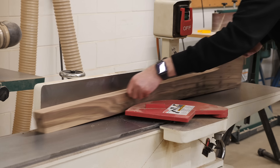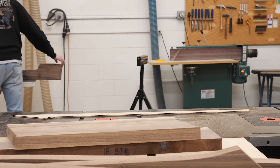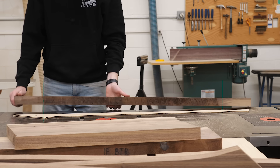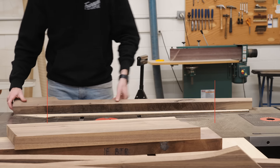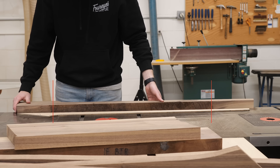In this shot you can see the piece touching the jointer bed on the two ends and almost comically high above the cutter head at the center. Each pass removes and flattens material, and you just creep up on a nice flat edge. In this sped-up clip — which lasted 14 minutes — you can see that with each pass I'm getting closer and closer to the clean edge I need. I know experienced woodworkers know all this, but a lot of viewers are newer to woodworking, so I thought it was worth including.